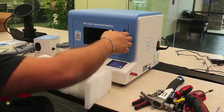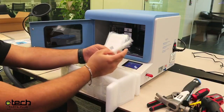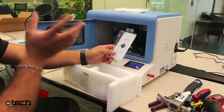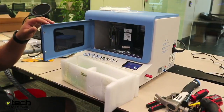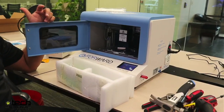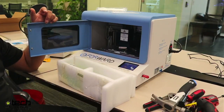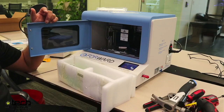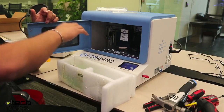Now I can go through the small cube because we're going to need these items. The first thing is calibration glass — this shows us what our calibration is set to. We run a template onto it to verify. The machine comes with about 10 pieces. For the calibration process, you'll typically use three to four glasses. If you run through all 10, you can reuse pieces by marking the old burn with a Sharpie so you know which is the new one.